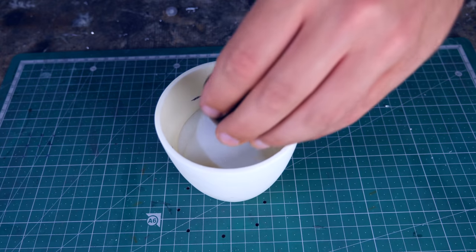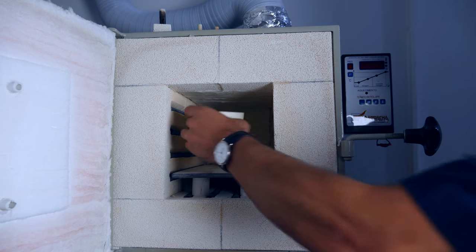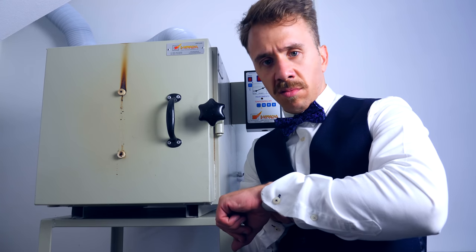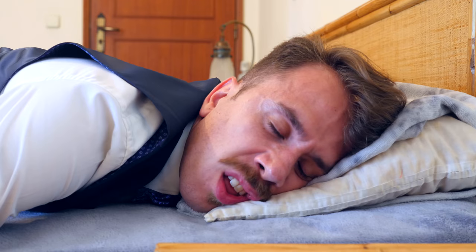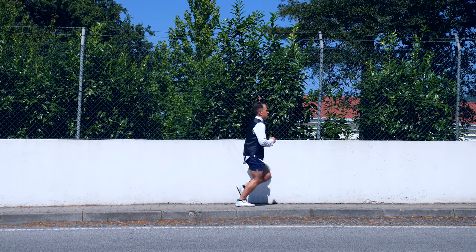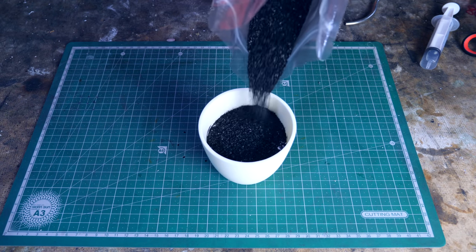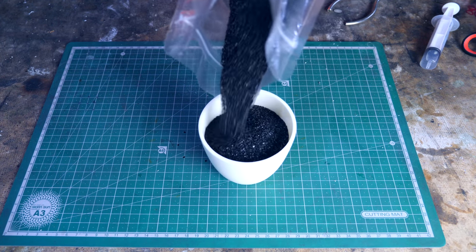Luckily I have one, its name is Barracha. Because the part is gonna get very very hot, it gets to a point in which it almost melts and because of that gets very very mushy — it only takes gravity to deform it. To give some support to the part I put it in a ceramic cup and buried it in alumina sand. Then I put it in the kiln and made it go through the debinding stage to burn off the plastic. This process took about 8 hours. Afterward I sprinkled it with sintering carbon because the next stage is the sintering stage and that means very high temperatures. The purpose of the sintering carbon is to protect the part from oxygen that likes to oxidize stuff.